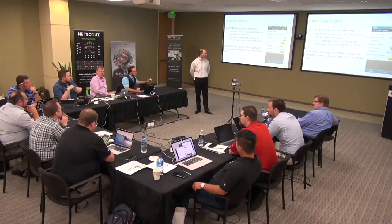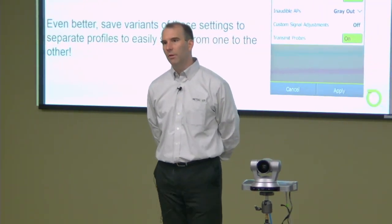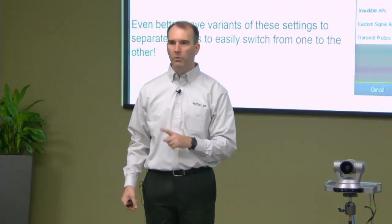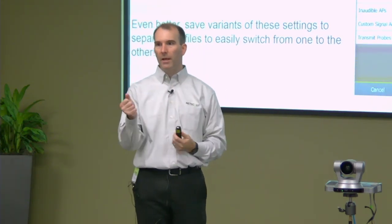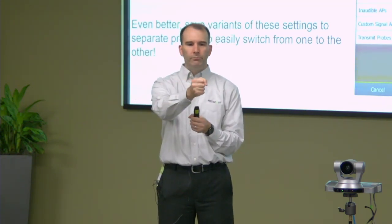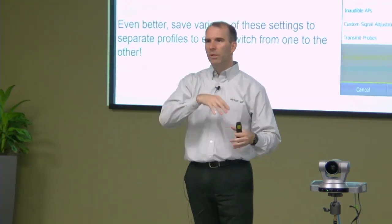Hey, Chris, can you talk a little bit about the external antenna? I've known a couple of people that seem to have confusion about what it's for and what it's not for. Sure. The primary use I would say the external antenna is for is locating something. Because you're taking the MIMO antenna that's inside, and now as soon as you say I'm going to use external, you're going one by one. You're plugging that little flag in, and the only antenna we sell is the flag, which is highly directional. So I always call it awesome for the lazy man who wants to locate something, because you go, all right, that way. Instead of having to try and make squares and collect multiple readings and walk around a whole bunch.